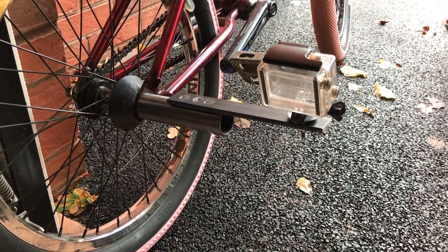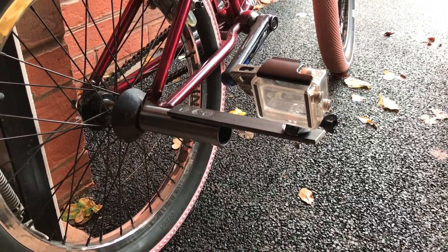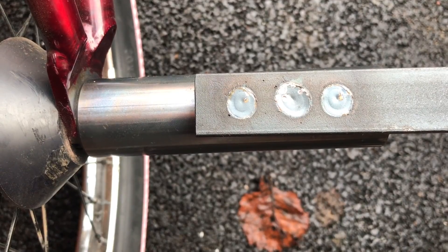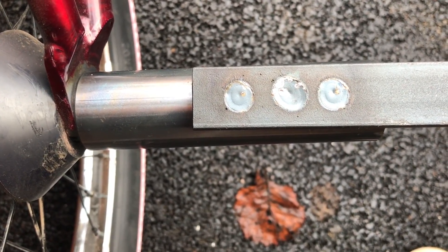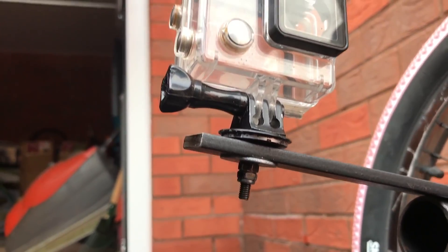Let's have the Christmas chat — I've got more important things to talk about. The 3-in-1 BMX peg. What you're seeing right now is a 3-in-1 basket peg. I machined up a basket peg, 5 inches long. I've got a bit of flat bar, a bit of flat metal, drilled a few holes in it, spot welded this flat plate to the peg, drilled a hole at the end of the flat bit of metal, and attached a GoPro to it. What makes it 3-in-1? It's a peg — you can grind with it — and you can attach a GoPro to it. That's 2.